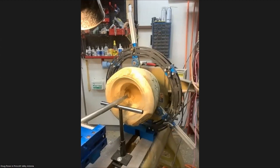One of the ways to combat that is, instead of working from the center hole, work from the top down into the center, from the top of the rim. Right, so that you keep things thin and keep the bulk of the piece where you're turning, between the headstock and where you're turning. So instead of hollowing out like he's doing now, you would go to the wall at the top of the piece, and then work your way deeper into the piece, going to the wall each time. Yeah, I turn almost all of my bowls that way. Yeah, that's how I do also. Well, and hollow forms, even with the closed hole hollowing, yes.